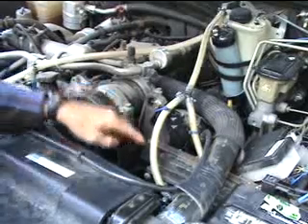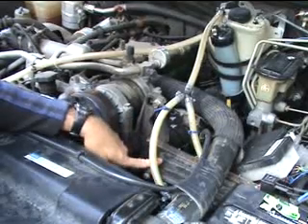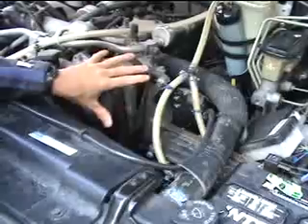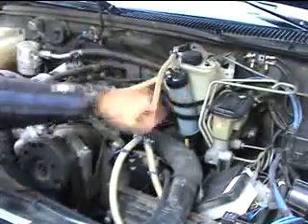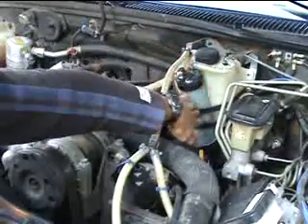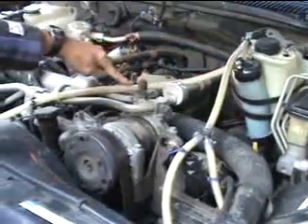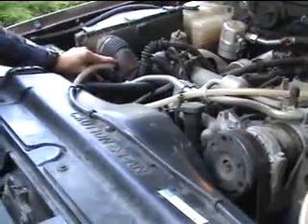This is a 1996 Chevy Suburban. I installed a hybrid cell 773 brick — a mega brick from Transitional Technologies. This is a standard setup: we have the mega brick mounted beside my alternator, with the reservoir back here. The lead to the brick comes from the bottom, and the reservoir is immersed in sodium hydroxide solution. The gas and foam liquid mixture percolates up through here, drops back into the reservoir, and clear gas comes into the bubbler which scrubs the last amount of liquid out. The HHO gas then comes down through this tube and is introduced into the air intake just in front of the turbo.